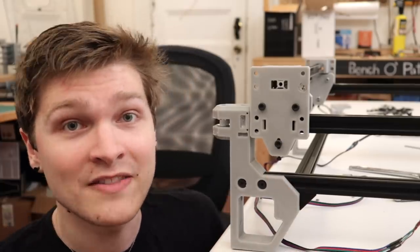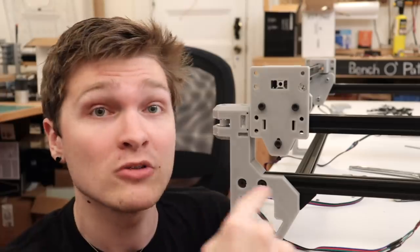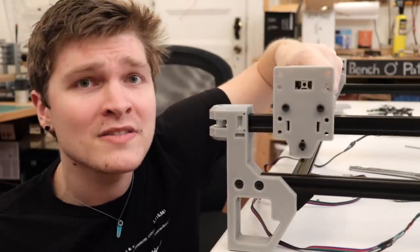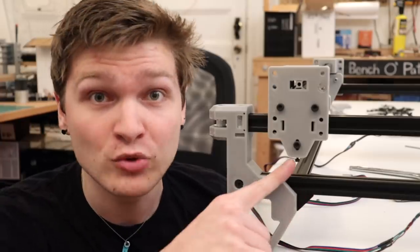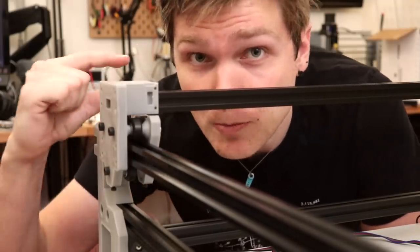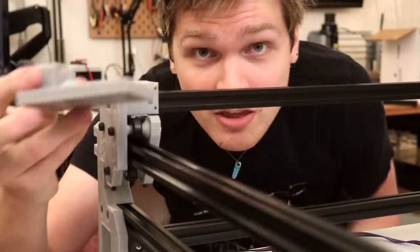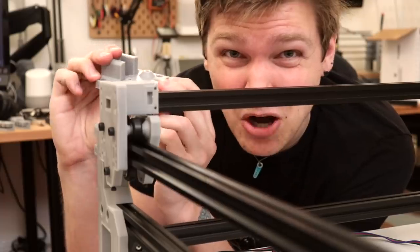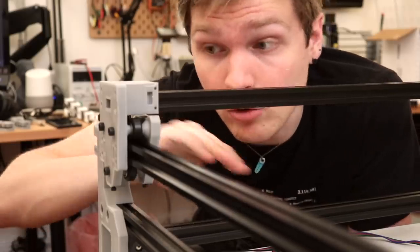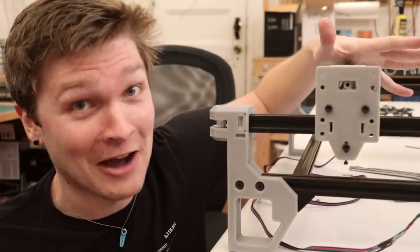On the bottom, there's only one roller in the center, and this roller has two small M3 screws on the bottom with a captive nut on either side. You can use those to adjust how far up the bolt the bottom roller goes, and therefore adjust your tension really precisely on both sides. No matter how hard I wrench on this thing, it's not going to get loose — it will never unscrew the tensioning bolts. It'll just hold dead fast. I also added an entire secondary panel to help keep the bolts super perpendicular to the rail. On the last pass, there was only one printed part for the gantry, and it actually bowed a little as I tried to tension things — it warped and detensioned on the rail. Printing another part that holds everything solid makes a world of difference. This thing is just not wiggling at all now.